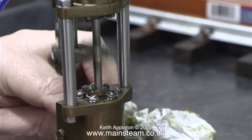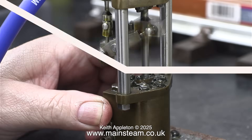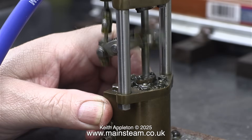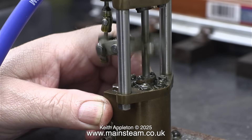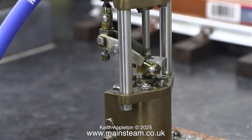Because the pump's been running for a while, the volume of oil in the bottom cylinder is not so much. I left it running and injected some more oil in an attempt to soak the gland packing material, because I presume it to be dry, but it made no difference — I need to repack the gland. On these pumps the glands are usually O-rings. The water cylinder gland was always leaky — even the ones my friend built exactly to the drawing always leaked. What I used to have to do was remove the gland cover and wind one turn of graphited yarn over the top of the O-ring, and that fixed it.